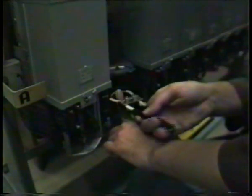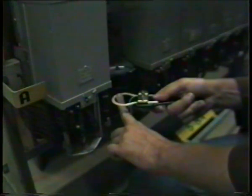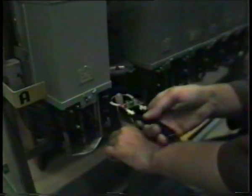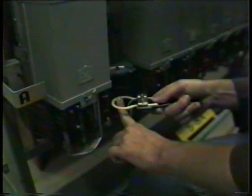Start with the upper 100B? Yeah, the upper 100B. Yeah, the switch has relays in it which can select between the banks. They discriminate — the HA and HV switching. I'll show you that in a second. That actually allows the switch to handle 200 lines.